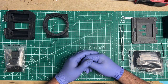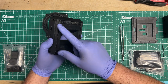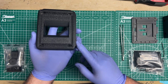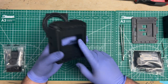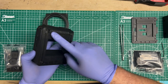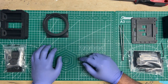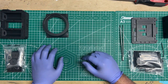With the DIY kit, I already cleaned it up for you, meaning I drilled out the holes already here, cleared out any debris, double checked it just in case, but I tried to be pretty good about that to make sure that you didn't have to struggle with that. But those of you printing at home, make sure that everything is cleared out. Otherwise, you're going to strip a lot of screws and nuts throughout this whole process and get stuck or have to reprint things.